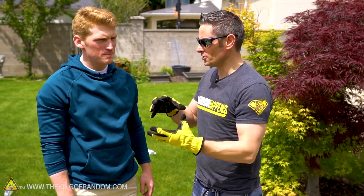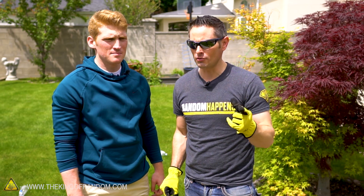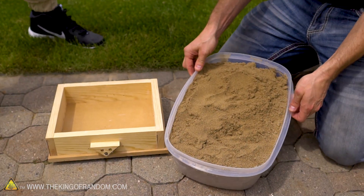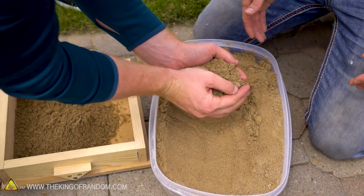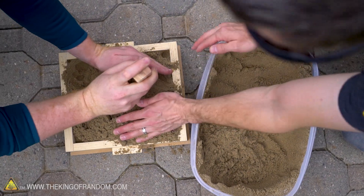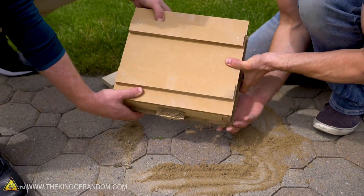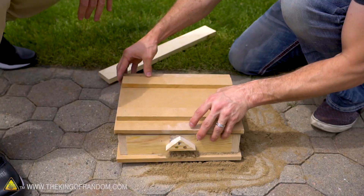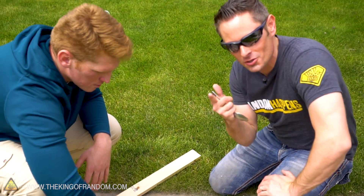We'll give that a few minutes. The copper is going to be so hot we can't use a traditional muffin tin as an ingot mold, because it will actually fuse to the steel — the temperature ranges are so close they'll bind together. So we have to find some kind of improvised way of making an ingot mold, and that's why we're bringing out the sandbox. The reason we're using sand is because sand is mostly made of silica, which has an extremely high melting point, and even if the ingot did stick to it, we could just brush the sand off. Dual purpose.